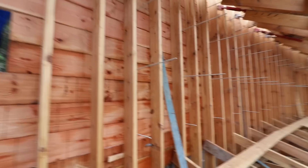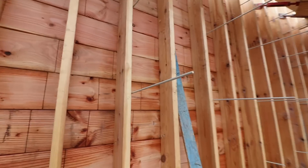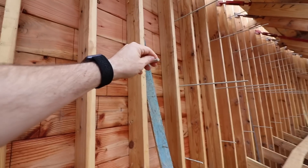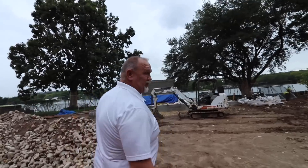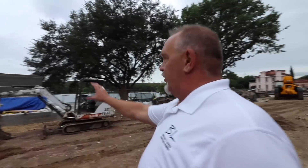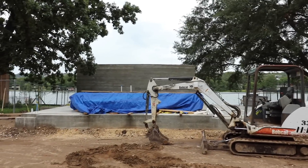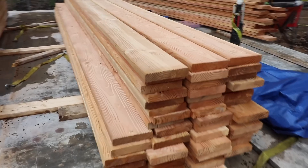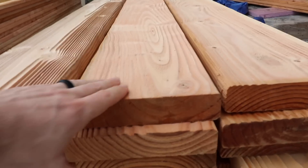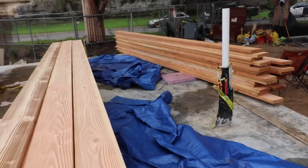And here are these fiberglass wall ties — they don't have the backside of these ties on yet to hold them together. We didn't notice them on that other wall, but they were there. They just totally disappeared. Chris brought those to my attention — I wasn't aware of that product — but yeah, you can't even see them. You look at that wall over there and those fiberglass wall ties are there, but they've totally disappeared. Are you sandblasting these boards here on site, Brian? No, we actually sent them off site because of the environmental issue with sandblasting in Austin — that would be a huge violation. Sandblasting is messy, so we wouldn't want it in a neighborhood like this.